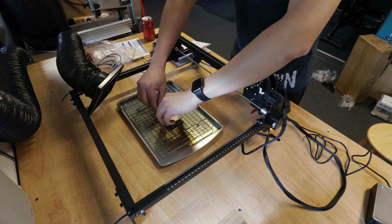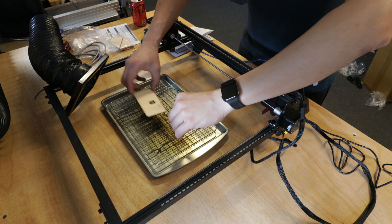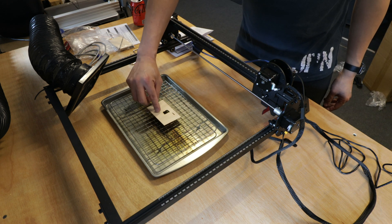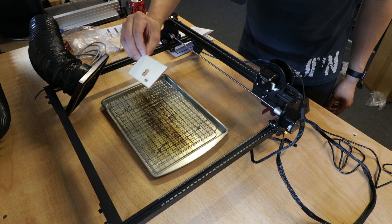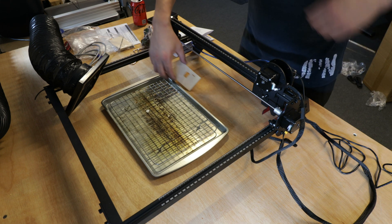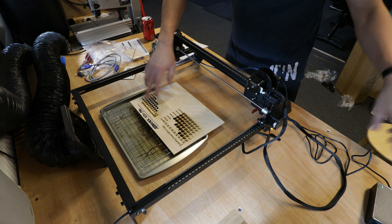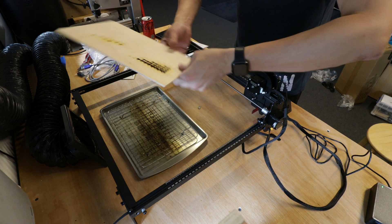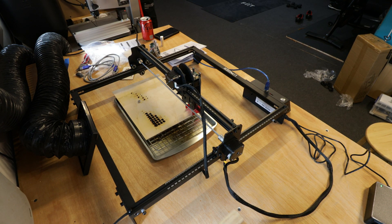This is 450 speed at 90 percent laser power, and it is a very, very clean cut. Obviously this is a very thin piece of wood, so it cuts through with no problem. As you can see here, this is what I tested the X20 Pro with using a power scale, so I'm going to do the same — I'm going to turn it around and use this part of the wood. All right, material test number one, we are go.